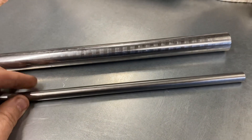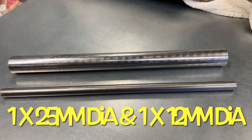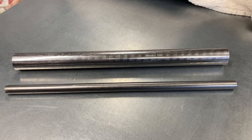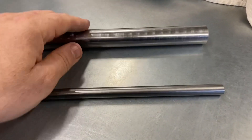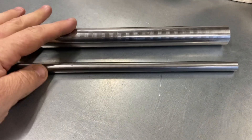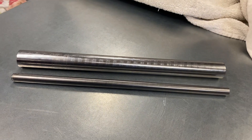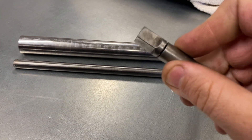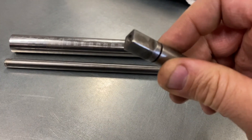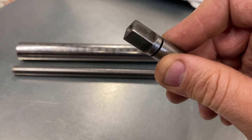Planning this job out, I've selected to use some EN16T steel, which for the Americans out there is very similar to 4037. In the UK, EN16T or its proper terminology is 605M36. It's a 0.36% carbon steel and it will harden nicely, because the original chuck key has got a hardened square drive on the end - that bit's been flame hardened. The hexagon drive we put on our end will replicate the flame hardening so the chuck key lasts and won't wear. There's no point making it at all if it's not the correct hardness.